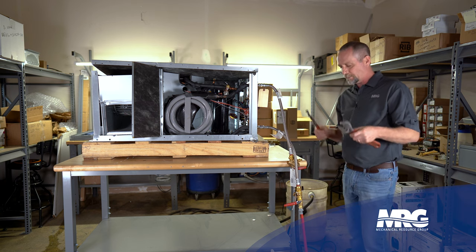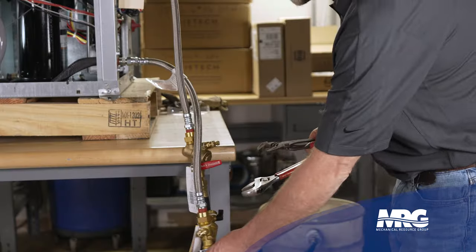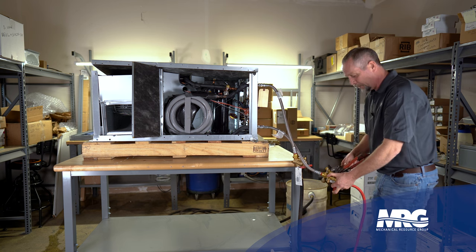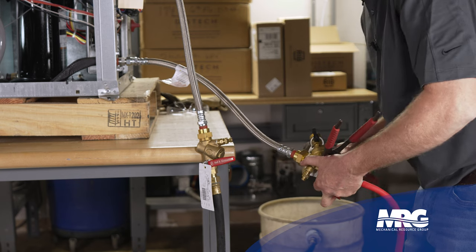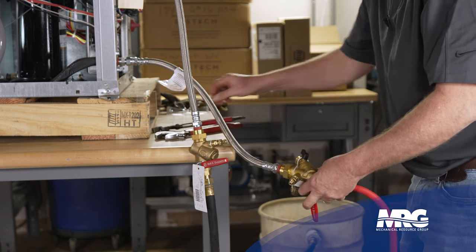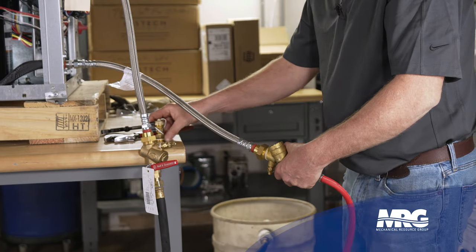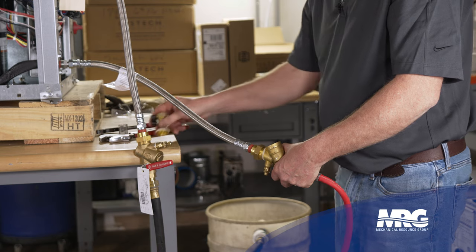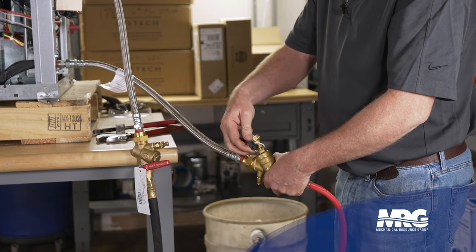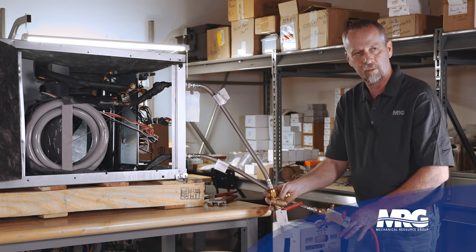Now we need to expose this strainer and see if it's dirty. You'll need two wrenches — typically a pipe wrench and a crescent wrench, or maybe two pipe wrenches. This is a pretty small unit, so I can get away with a pipe wrench and a pair of channel locks. The key to it: as crazy as it sounds, if you have them spread way apart it won't budge. If you just put your wrenches together, it only takes one hand to spin that. So we've loosened that up, opened this up, spun that cap right off. We've cleaned our strainer, set it to the side. Then we're going to put our cap back in with our little valve, screw that back on, and close this drain. Now typically our water flows this way, goes through, and comes back out.